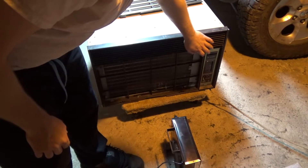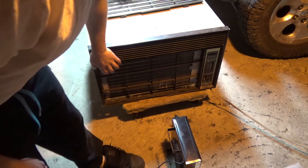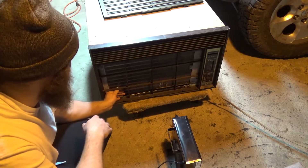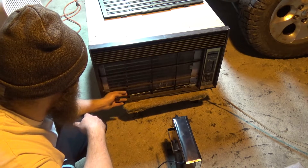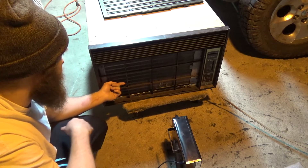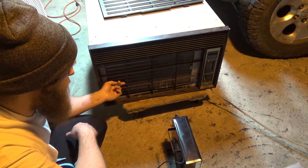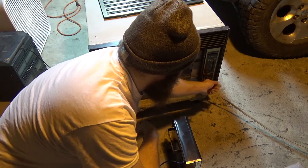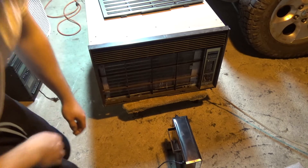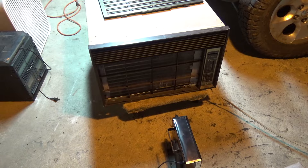Well, it's cold pretty much all the way across now. It's definitely colder on this side but it's cold most of the way across. The coil — yeah, it's still only cold at the real bottom. The surface temperature of the coil is cold up to there now. So it's getting better but it's not quite what it should be. I'll give it some time — let it build up the head pressure. It hasn't run for a long time so it's going to need a few minutes at least to get going.